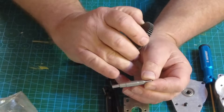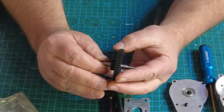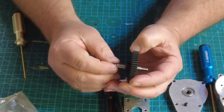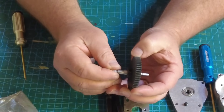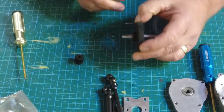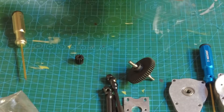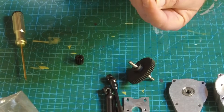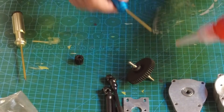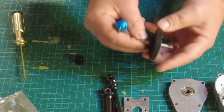We put the shaft in so that the slotted flat spot passes through in the correct direction. You can just see where the edge of the flat spot changes with the diameter of the shaft - that's where it should go. We have an M5 grub screw to position it into the right location. With a degree of confidence, I'll apply some thread locker on this - I don't want it working itself loose.